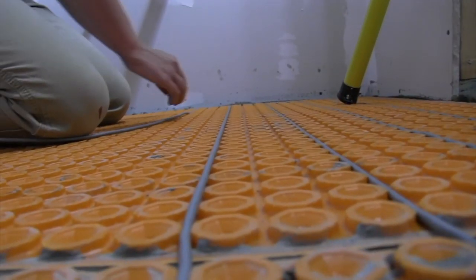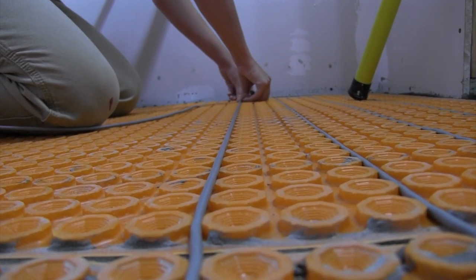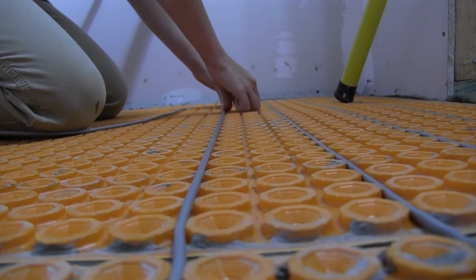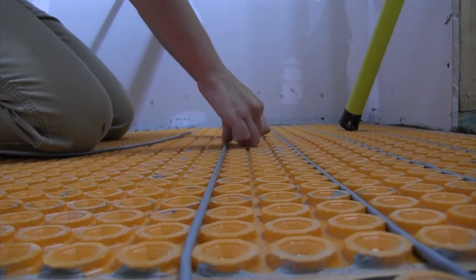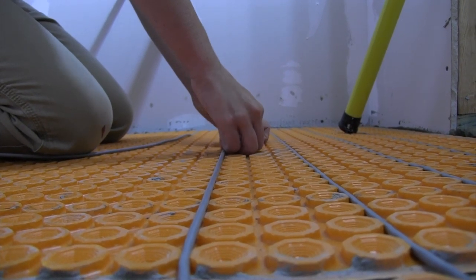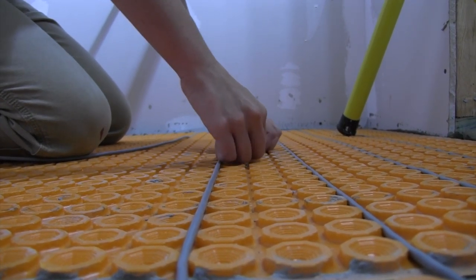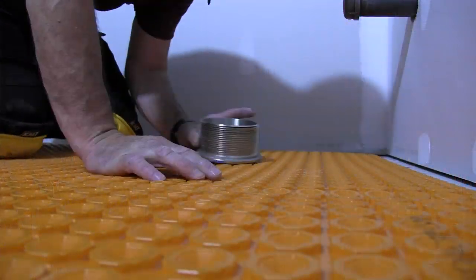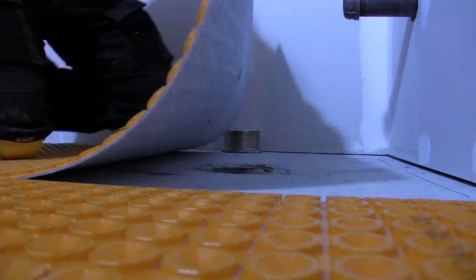The problem with concrete floors is that the cold concrete absorbs all the energy and it significantly increases the time it takes for the tile floor system to warm up. In some cases the floor may never reach a desired temperature on a thermostat. This is even more of an issue when there's no insulation beneath the concrete floor, which was our situation — this bathroom had no heat source and there was no way to add it from the existing system.